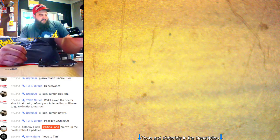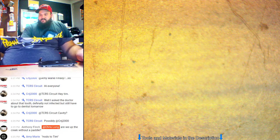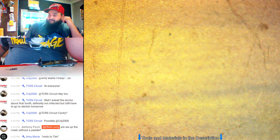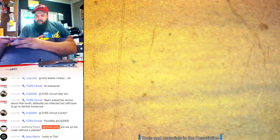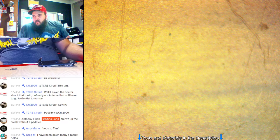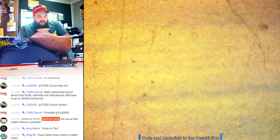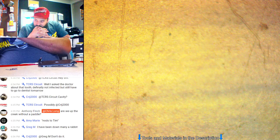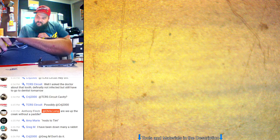Alright, so we got Apple logo. Let's see if we get any other signs of life other than Apple logo. I'm watching the amp draw right now. The crazy thing is the amp draw looks normal for a little bit and then it goes kind of weird. So right now it's drawing about 700, back down to 300, up to 700, back to 300, 700. It looks normal, but then it usually gets to a point where it just drops off, like to 100 milliamps, and then it's over with.